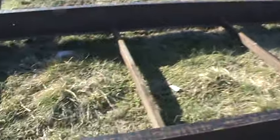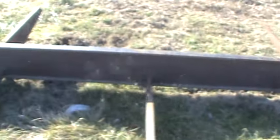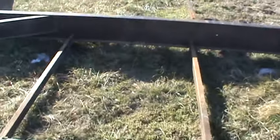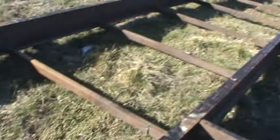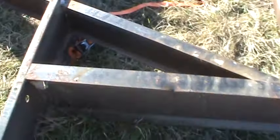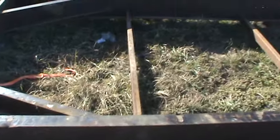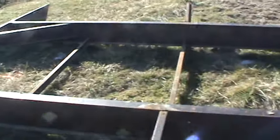What I want to do is technically just flip this over. It's got little runners going across, and once I cut these all out I want to add them in about a foot apart. Then when I flip it over, I'll take two-by-fours, two-by-sixes, or two-by-tens — pressure treated boards — and lay them all across the top to make a nice strong deck. On the side, when I flip her over, I'll cut some notches in the I-beam and weld in a box steel slot so I can put sides on it if I want, or take them off. If I want to haul logs, I can put steel posts in there — the options are endless.